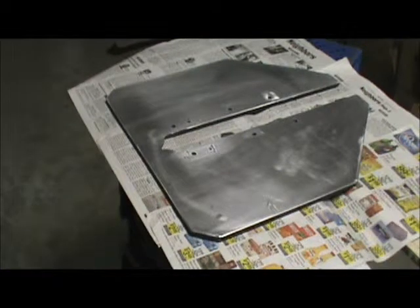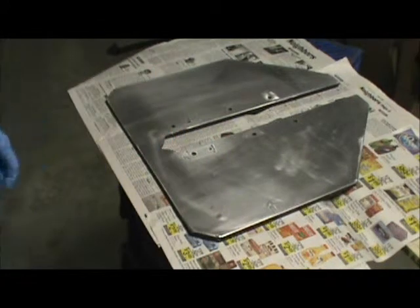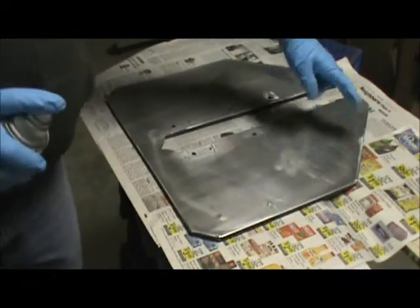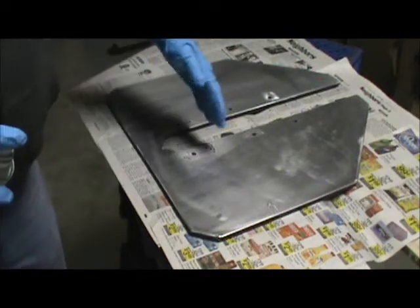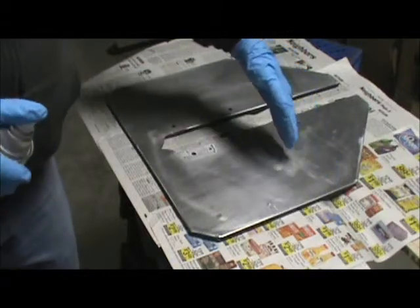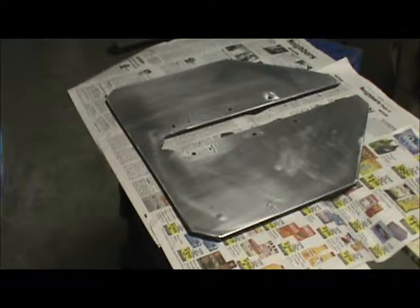This will turn out pretty well. There's a few scratches in this metal that paint won't hide, but I'm just going to give you the gist of how to get the best mileage out of your spray paint. Give your can a good shake — I've already shook this one up well. What I do is outline the area I'm going to paint first, then make straight lines across. That way you know where you're at and you're getting good coverage. So let's get going.